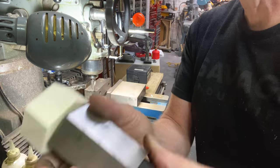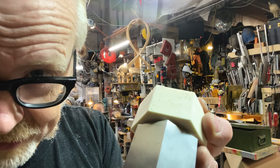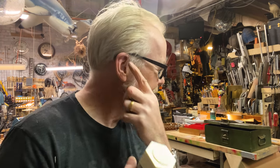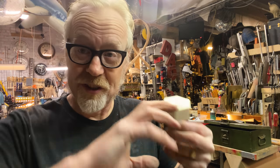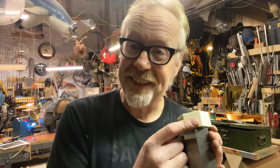Now, a note, I think careful eyes could see that my resin is a little bit Swiss cheesy. That's because this is old Instacast, and if you don't buy one of those casting material savers that sprays nitrogen in before you close up the... How do I say this? Okay, the reason this looks like Swiss cheese is because it's old Instacast.